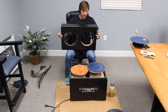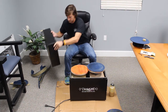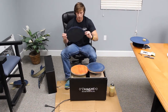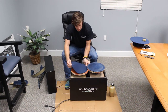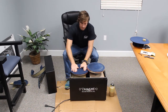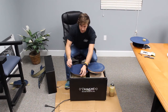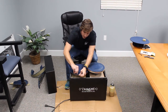So I have the new Velcro in there. I'm going to let it set up for just a second before we place the carpet in there. By this time, I can take my replacement pad, glue side down, and place it on to the platter. Again, you'll want to take your razor blade and cut off the excess around the top.